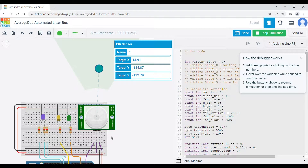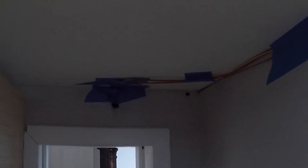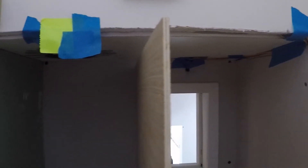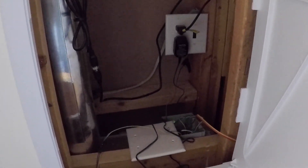Check the Tinkercad link in the description to see the circuit I built and the code I wrote for it. The RGB LED is mounted above the entry to the box, and the wires come up and go through the crack between the ceiling and the wall. On the other side is the motion sensor, which I blocked off with some tape so it would not detect the cat until he jumps all the way down into the box. The hole in the drywall is covered by the access panel, and inside you can see the Arduino board sitting in the outlet box with wires from the motion sensor on the left and wires from the RGB LED on the right, hooked up just like it was on Tinkercad.